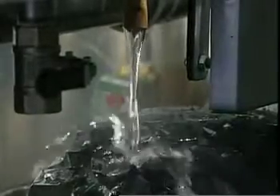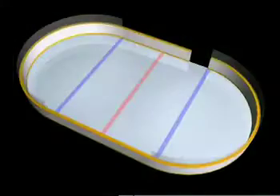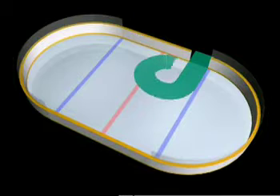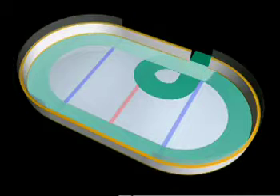If not equipped with a tire wash system, hose down the tires to prevent dirt and debris from being carried onto the ice. Return to the ice surface and drive alongside the boards and carry out the standard ice resurfacing pattern as shown in this diagram.